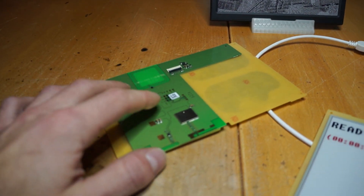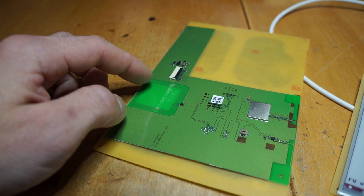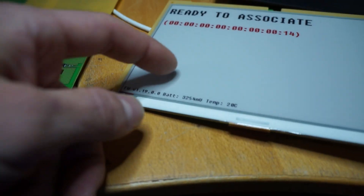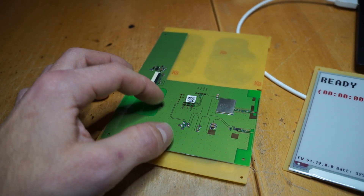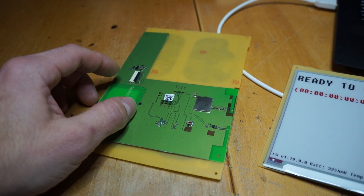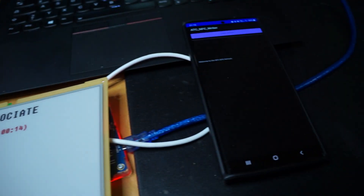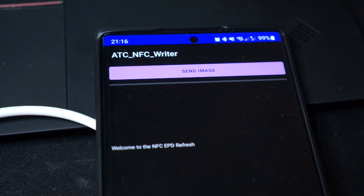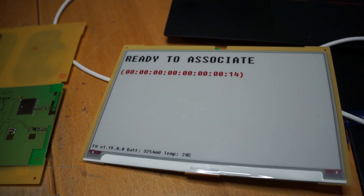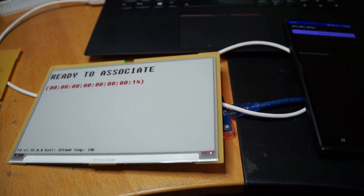They also have these NFC chips and an NFC antenna which you can access from the front. Not all have these NFC chips, but the ones that do are quite interesting to play around with. I worked on it the past few days to finally implement an Android app to communicate with the 88MZ100 microcontroller and upload compressed images to it.